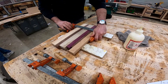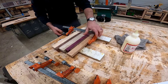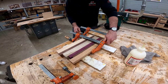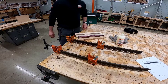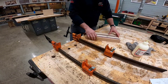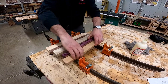Now it's time to complete a dry clamp up. If you're using F-clamps, make sure you have two sacrificial boards to elevate your pieces off of the bench. Start by clamping in the center and then add two clamps on both ends. F-clamps are great and will work just fine, but oftentimes we encourage you to use bar clamps — it's way easier to glue up panels using bar clamps. The bars go down on the bench and the wood goes on top of the bars.